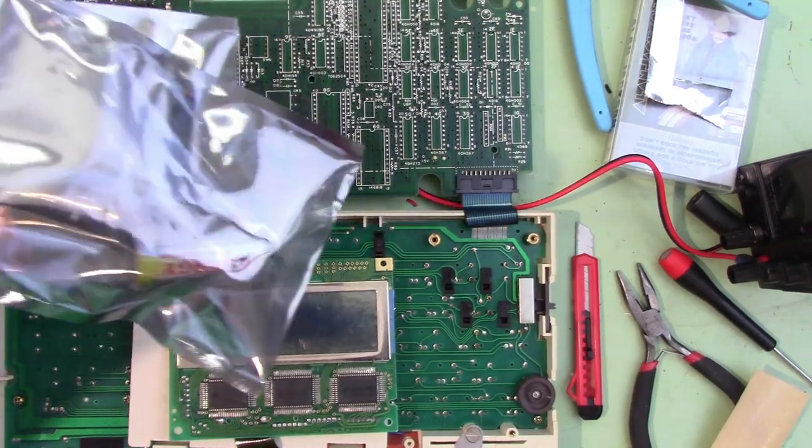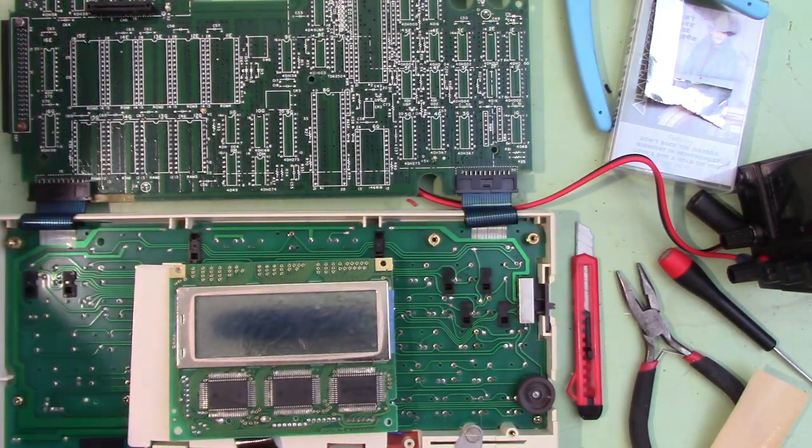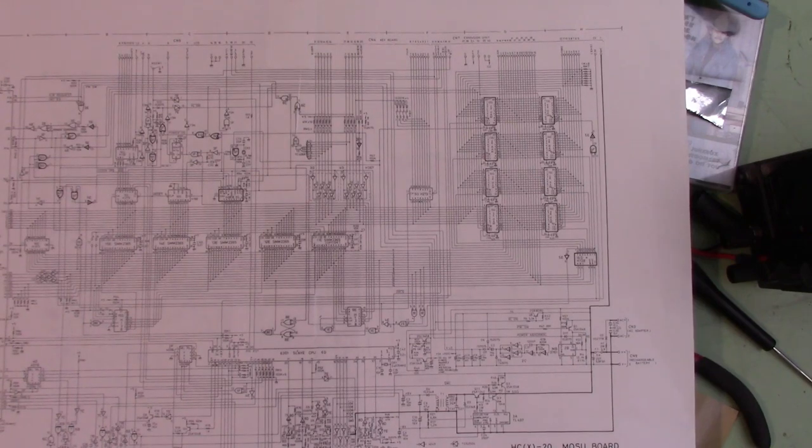It's a new day. I got batteries in so we can build a battery pack. I went online and found some schematics on vintagecomputer.net — I'll put a link in the description. I'm going to start tracing the power. When I first cut it on yesterday, I could hear a little sizzling noise — it sounded like maybe some battery acid was conducting something and boiling off. Then the current went to zero. So it doesn't appear this thing is pulling any current. I'm going to start tracing that and see where the voltages go.